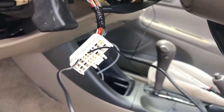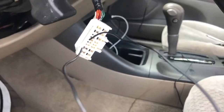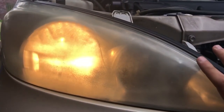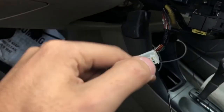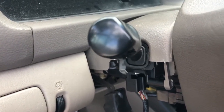Using a small wire to short the appropriate two pins, I confirmed that shorting those pins turns on the low beams. I can show you — these are the high beams and these are the low beams. With the pins shorted, the low beams come on. That confirms the issue is not the wiring going all the way to the headlights — it's this small device, the control switch, that controls the switching on and off.